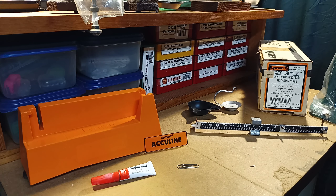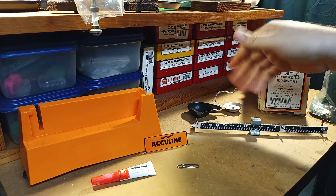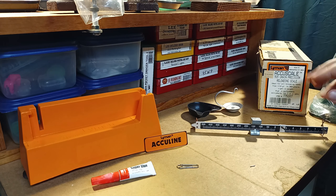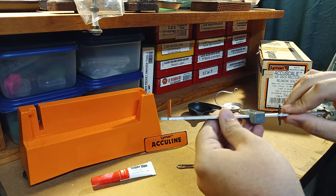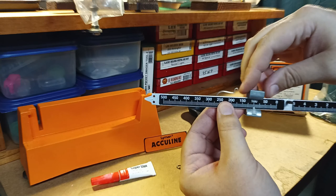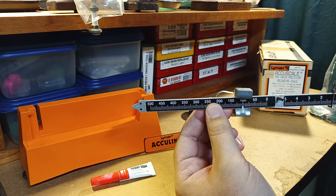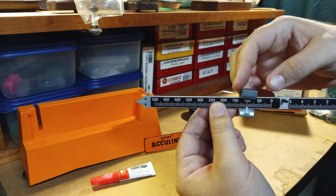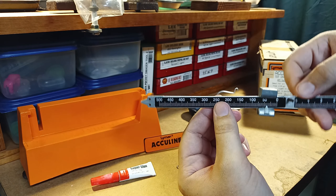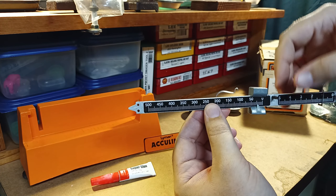What was wrong with it: it would lose its zero over time. If you're using the same pan and arm and all that, you shouldn't have a problem. The knives were fine, everything else is calibrated to the pan. But on the back side there's a tiny little hole, and that would keep this slider from moving. You've got a notch you can tangibly put in a groove and it won't move, but when the scale actuates back and forth a few times it just keeps slightly bumping — there's nothing to stop it.